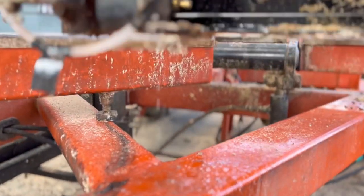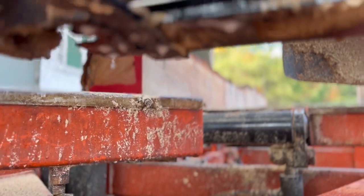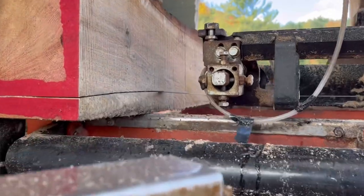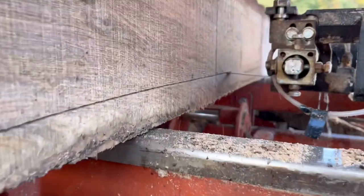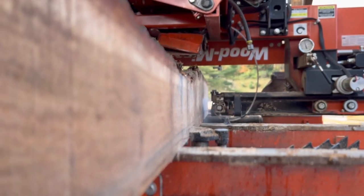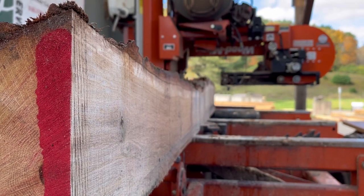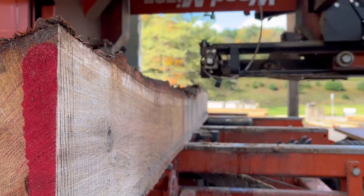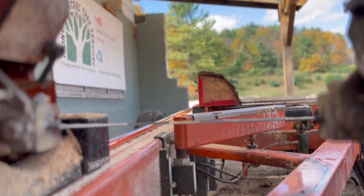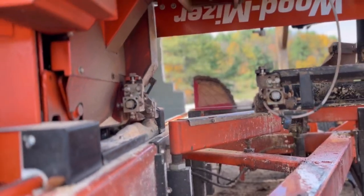I flip the wedge so that the bark is facing the other direction and cut from the bottom again. I make my cut at 1 1/4 thickness. This gives the woodworker a little room to work with if he wants to plane the board. Basically, you just flip your wedge back and forth every time you make a cut until it's too small to cut again.